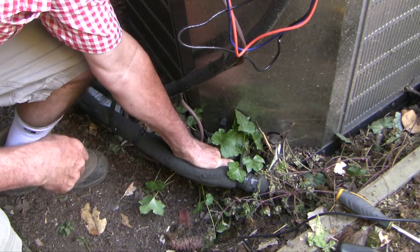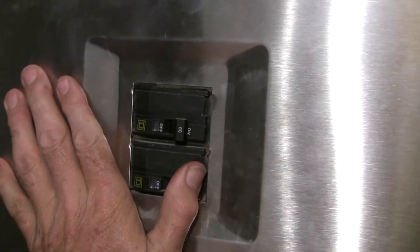My pipes are cold — it's working. I took the batteries out of the thermostat, cycled all the breakers including the indoor breaker, and that trouble code is gone. It's stayed gone for the last week and the heating and cooling is entirely back to normal. That said, I think it's safe to say this system is still at high risk for recurrence in the coming months, which raises the question of whether we can do anything now to reduce that risk.